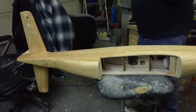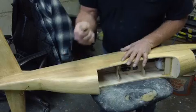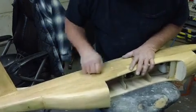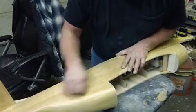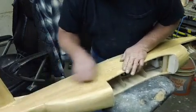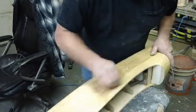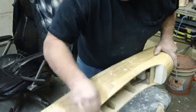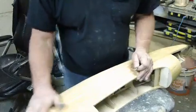You don't want to sand this stuff, because your sandpaper will get in there and cut the grains of your cloth. Just hold a brand new razor blade, straight up and down, real tight. See all that stuff flying off of it? It's just so smooth — the stuff just flies right off. And man, that just does it so smooth.